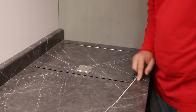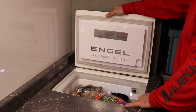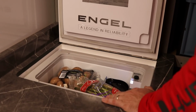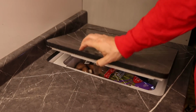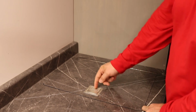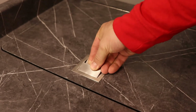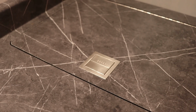You can see I've cut out a plug out of the counter and then built a frame to hold the fridge unit, because it's mounted by hanging from the four corner tabs here around the lip of the top of the fridge. And so I made some plywood mounts for that, and then edged all the counter, and it's of course just hinged along this right side here. And then I found this really clever door handle that's meant for sliding doors or pocket doors in a house, but it works really nice as a flush mount handle for opening the fridge.